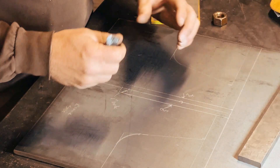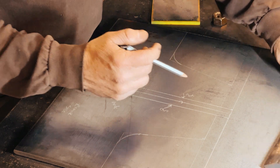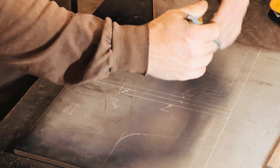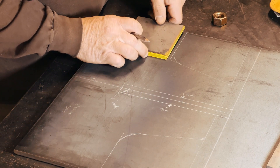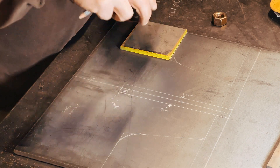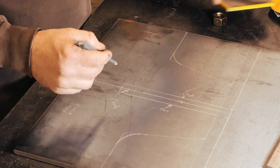One side of this upper roller I need to make removable - I will explain that later when you see the finished product. To do that, I am going to be bolting it down through with these pieces. And because of the pressure, I'm going to need to put some gussets here. I've made a couple of changes down here. I'm fixing to plasma cut this, then I'll do the other side because they need to match exactly. Here's a four-inch plate that will be going here for extra reinforcement because this is going to be extremely heavy duty. I will go ahead and weld this to this plate before I drill the holes because everything has to line up perfectly or it's going to be out of round and squirrely. Now we'll head over to the plasma cutter.